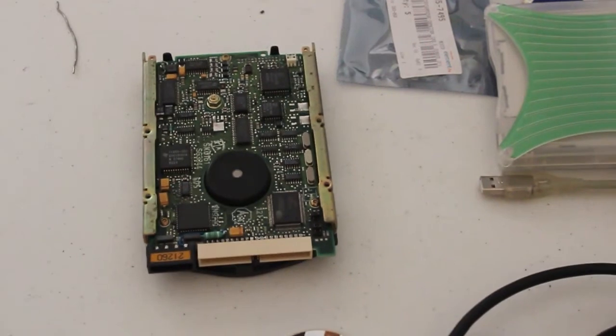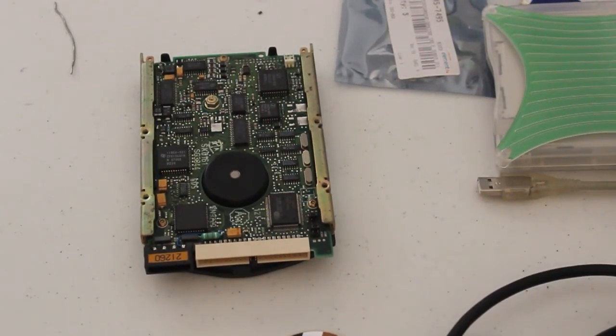I'm going to go ahead and replace the other capacitor as well, just since I happen to have replacements. With these types or any type of electronic component, the less heat you can apply, the better. A 25 watt soldering iron is sufficient for this sort of thing. Personally, I'm a fan of the 40, but after melting so many pads on that Xbox and having them turn to a charred mess, I'm going to give the 25 watter a go. We'll see how it turns out. If it doesn't work for everything, that's fine, but it's my new soldering iron of choice.